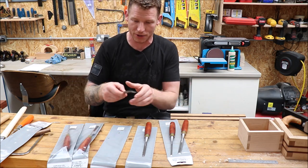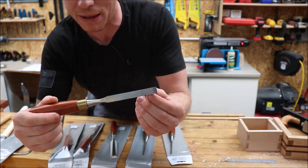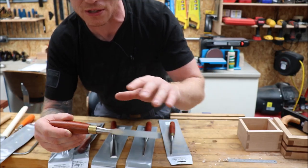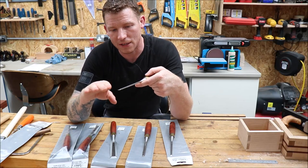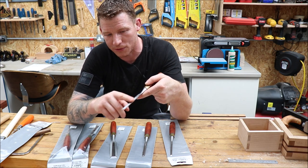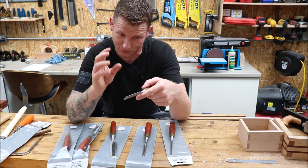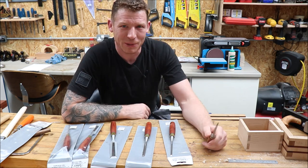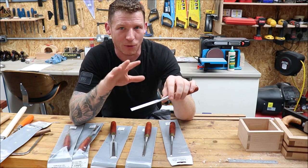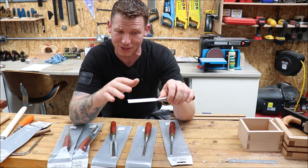So they're hand ground — I'll show you that. If you can see the grinding pattern on the back of that chisel, you've got a flat point right behind the blade and right at the end of the chisel. What they do is grind in or polish in a slight concavity in the back of the blade — they work out the center of the back of the chisel, and it's only to a couple of thou. It's still flatter than the sole of your plane.